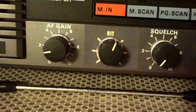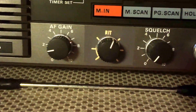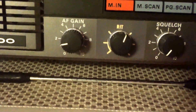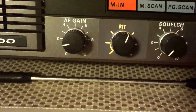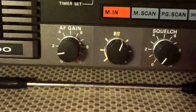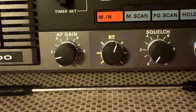It really isn't that, but I'll tell you what it is. By all accounts, it's a modification done at Universal Radio in Ohio. Basically what they did was they changed the tone control, used the pot that was in there, disabled the tone control and set it at the middle or default setting, changed some diodes in there, and wired a few things up. This is a very useful modification — it allows you to tune your beat frequency oscillator.